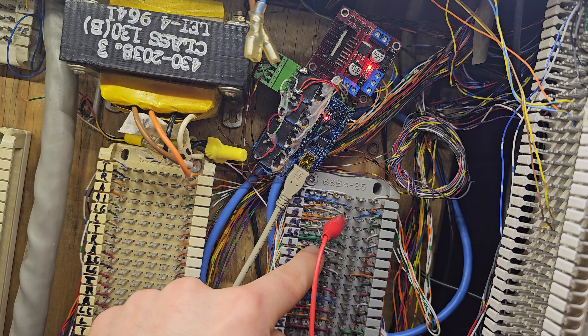Originally it could only do two lines, so you would hook it up to whatever two lines and if it detected a supplementary hold, it would switch the lamps from one or both of those lines to the extra flutter generator so that you would get the priority hold flutter. I'm still going to have to finish up actually getting the program to go on priority hold and be able to switch relays back and forth. What I have here is an Arduino Nano hooked up to these four relays.